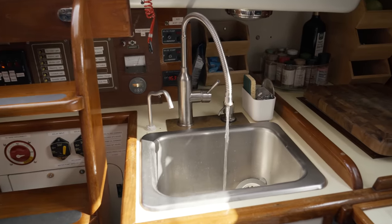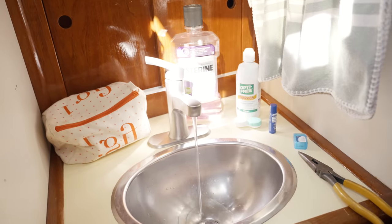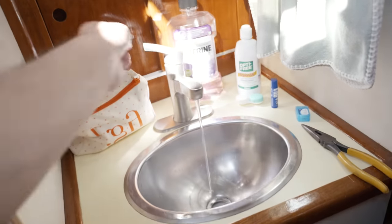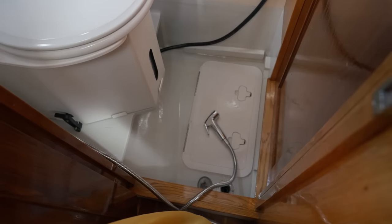Okay, so we have primed the system. Get this one going here. And I'm switching them back and forth from hot and cold. And I ran the shower into the sump and drained it as well. The system is holding pressure, so that's good. I just hope these lines all clear themselves. Of course, with that black gunk we got out, I think everything will be okay, especially once the bleach sits in here for about 6 hours, and then we'll run the whole thing out and then start flushing and flushing and flushing with fresh water.